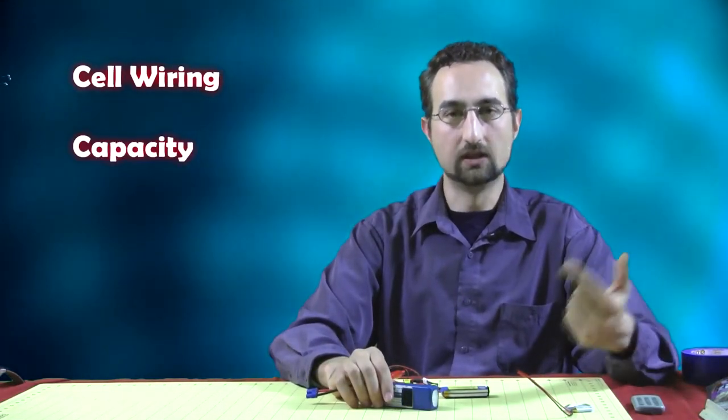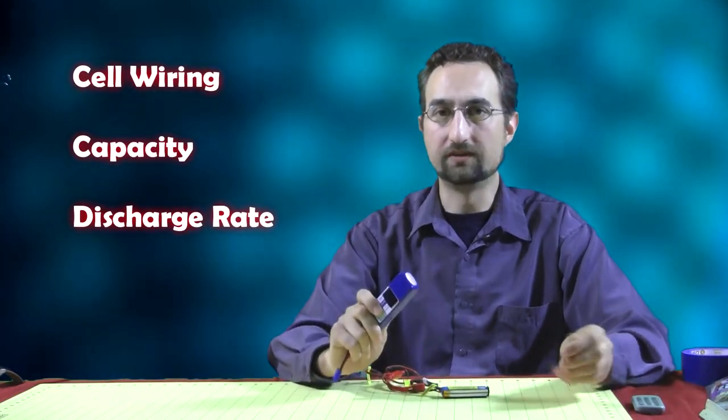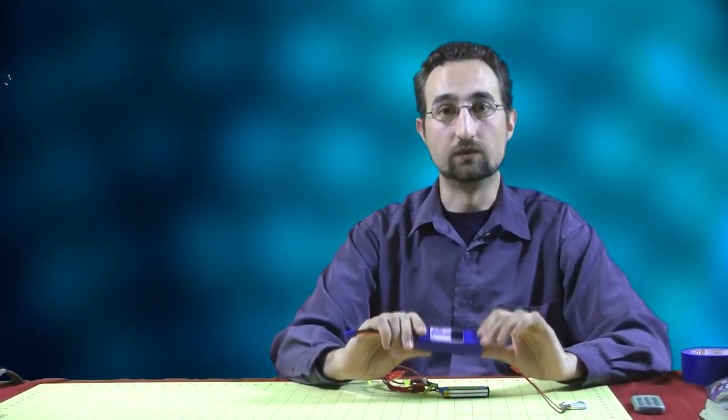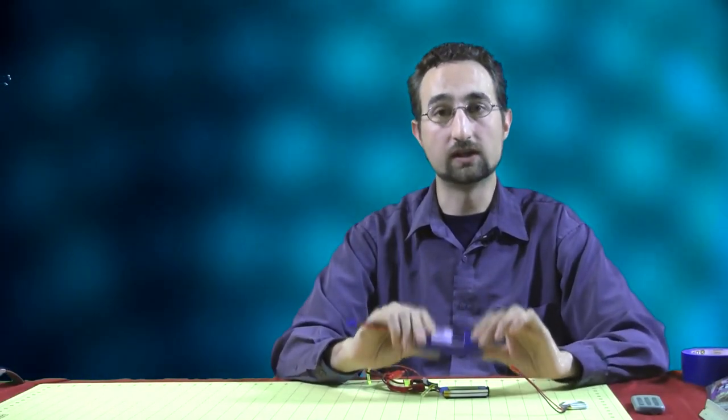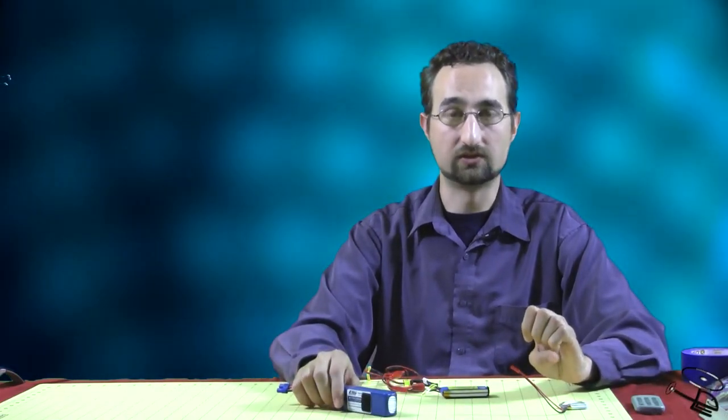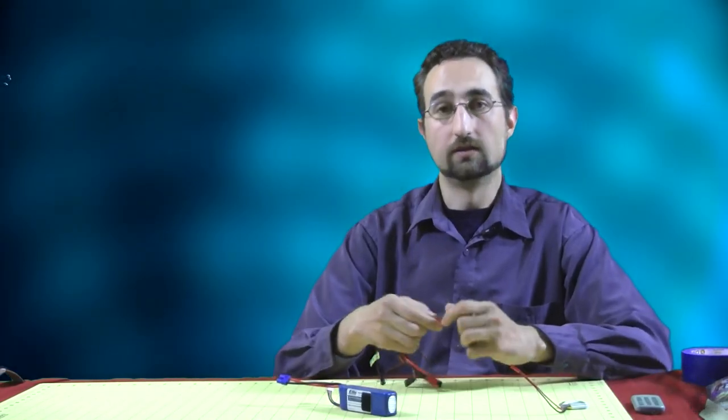Take the three parts of lithium polymer battery characteristics we just discussed — cell wiring, capacity, and discharge rate — and you get an idea of what differentiates one lithium polymer battery from another. Series gives more voltage, parallel gives more capacity, and combinations of both give more of each. Your capacity is your fuel tank, and your discharge rate combined with capacity gives you the maximum amps you'd want to pull through a battery safely. I'm Eric R. Christoph of Hover and Smile. We'll continue with our next video in the RC circuits and components series quite soon. This has been Lithium Polymer Batteries.